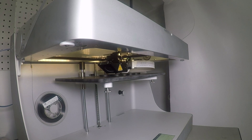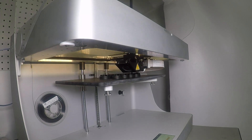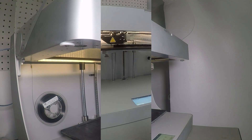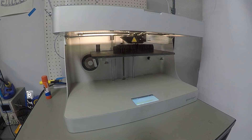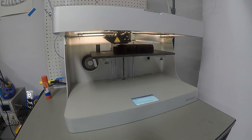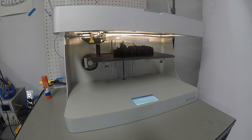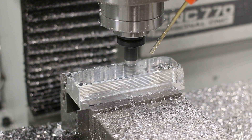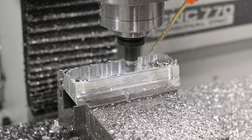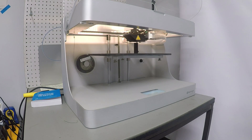Last but not least, we're 3D printing the pistons and we're 3D printing the crankshaft. We 3D printed the pistons just because we could — on the next engine we make, we'll definitely machine the pistons. The crankshaft is a little trickier; let me know in the comments below how we can machine a proper crankshaft. The Markforged did great — no problem printing a crankshaft with all this varying geometry. One of the things we really love about the Markforged, aside from the fact that it just works, is the support material tears off really easy and reliably. Hope you folks learned something, hope you enjoyed — we've got more coming. We've got to machine the two head covers as well as some more laser cut and 3D printed parts. Take care folks, see you next Wednesday.